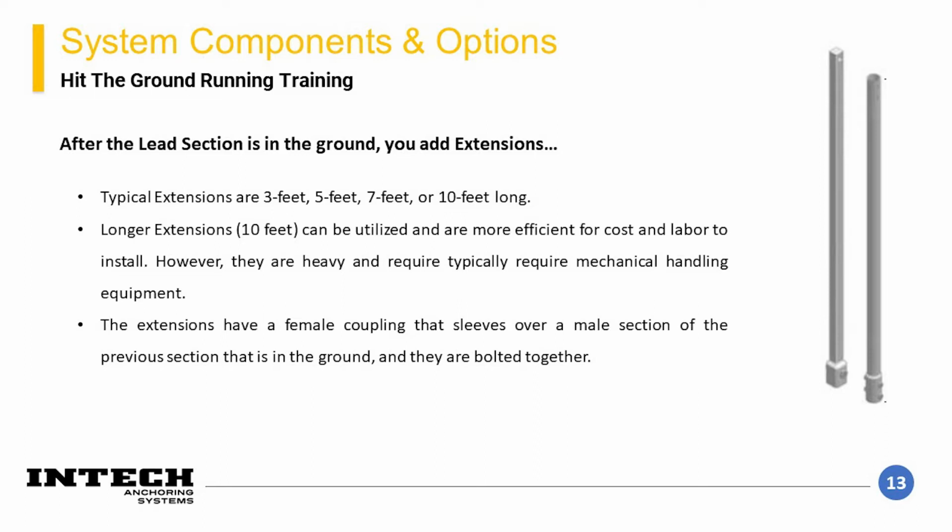This would also require drilling a new bolt hole in the shaft of the remaining extension section. Cutting and drilling should be performed in a manner that does not affect the structural integrity of the pile materials surrounding the cuts or holes. Special care should be taken to remove the materials cleanly and in a location that is relatively consistent geometrically with the original location of the hole.